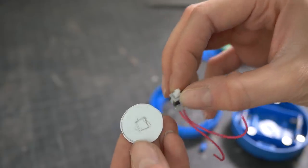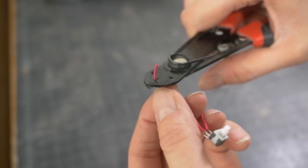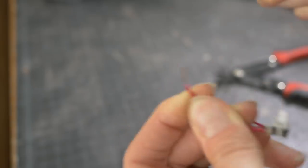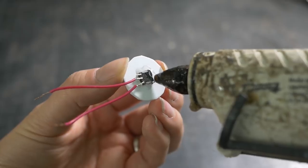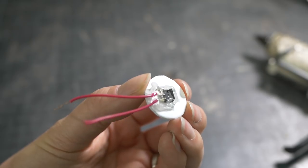I cut a little plastic circle that will fit into the forearm where the switch will be. The existing wires and solder connection looked fine, so I stripped the wires and hot glued the switch in place. The exposed wires were completely covered in hot glue, which is an insulator.